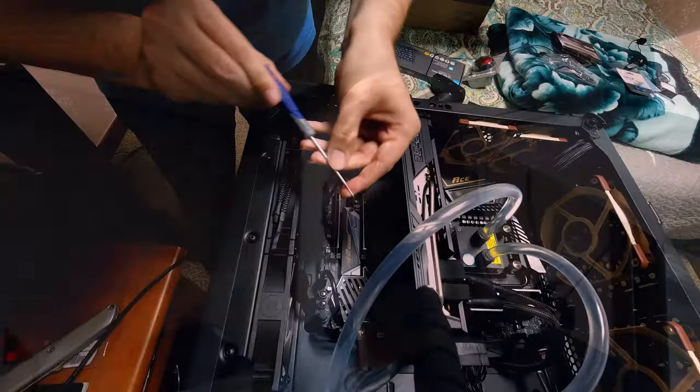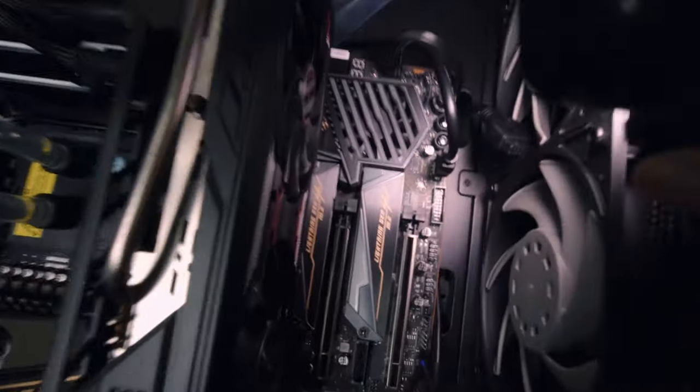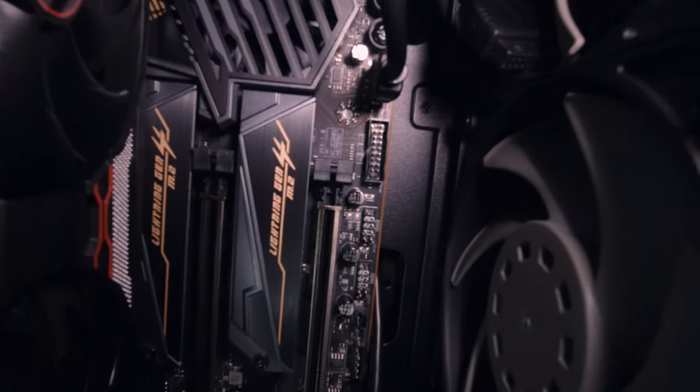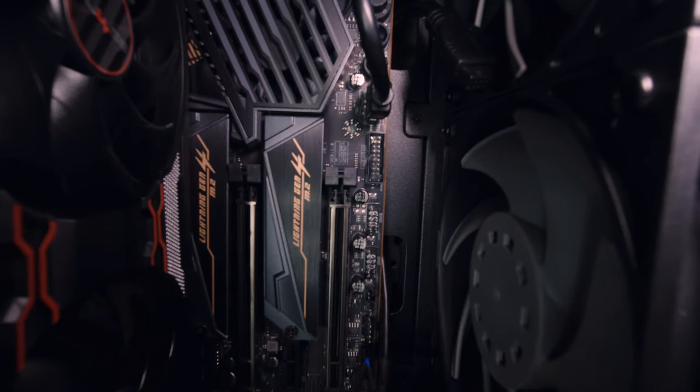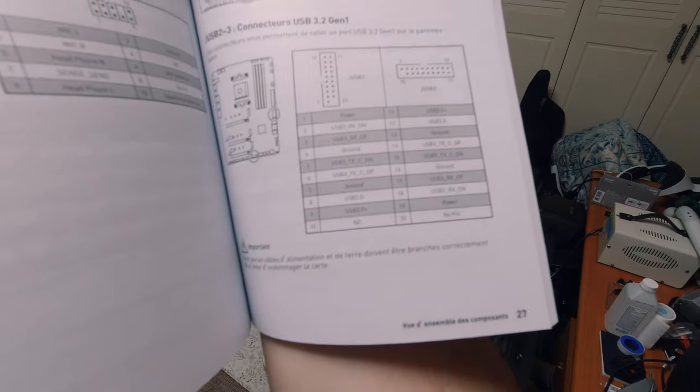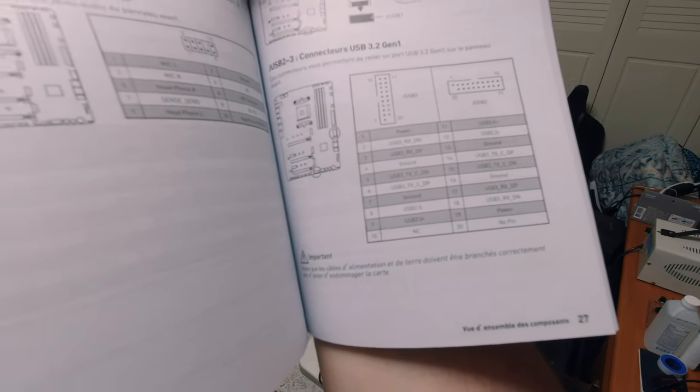So now I have to unbend that pin so I can plug that cable in and hopefully have all my USB ports available without having screwed up my USB 3 ports. Well, as usual, I've screwed that up. If you can see the port right there, I have done exactly what I didn't want to do — I managed to snap off the number 10 pin. At least according to the manual, I believe it says that pin 10 is NC, so I'm hoping that means there's no connection on that pin. That's my only hope that I haven't screwed this up beyond all recognition.